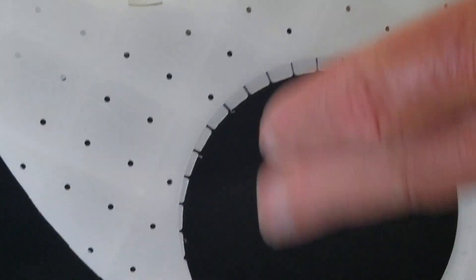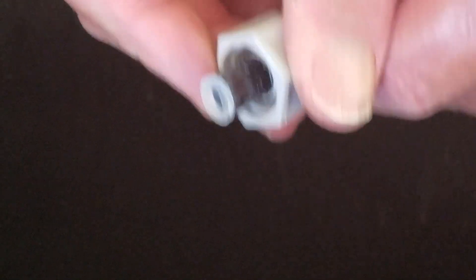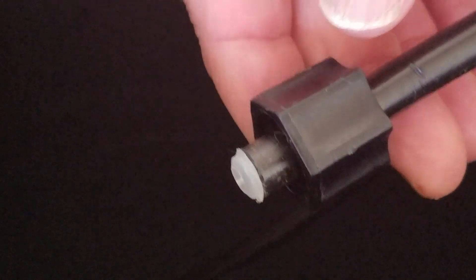We're going to start with the assembly of the brine tank. The tube slides into the tank facing towards the outside hole of the brine tank. This tube is also in the brine tank — you're going to pull it out beforehand. It doesn't have the nut on it. You're going to stick it through the tube, slide the gray nut over, slip the insert inside. And then the other end has a black nut — you slip it over and put the insert in.